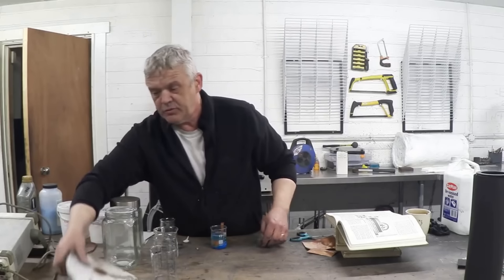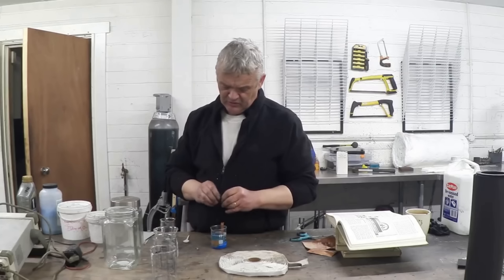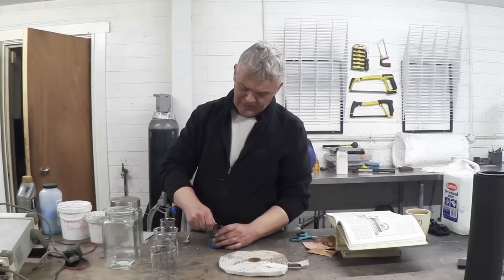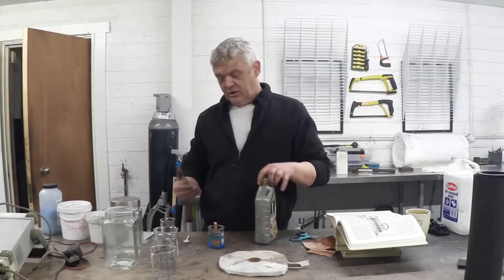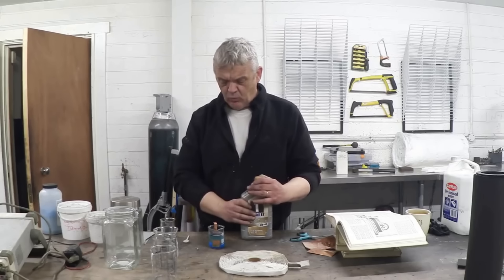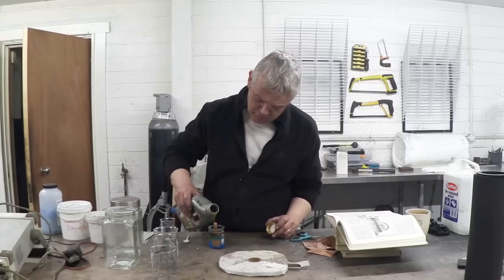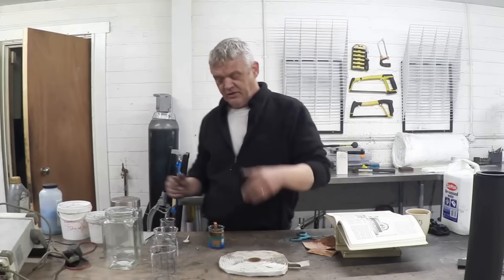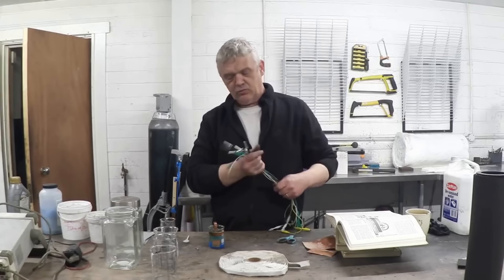I've got a bit of butyl rubber here which I'm using like blue tack to fix the zinc onto the side of the jar just below the solution level. That is my battery. It will salt-creep as the zinc sulphate increases and evaporate, so to stop that I'm pouring a little ordinary machine oil gently on top. That forms a seal. If you want to refresh it, stick a siphon in, siphon off the oil, and drop the copper sulphate straight through. It takes about 15 minutes or so to really get going.